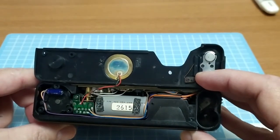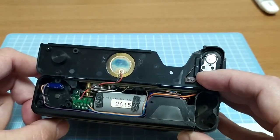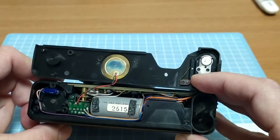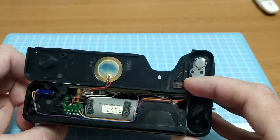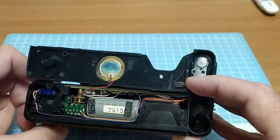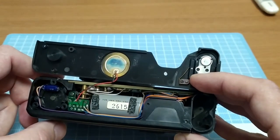It's obviously the very large flash capacitor. These capacitors typically range between 240 to maybe 400 volts and they usually hold a fairly decent sized charge too. For that reason, and because I heard the sound of energisation, we're going to make a discharger and show you how to discharge the capacitor before we carry on with too much work. They do give enough bite that they could actually potentially be lethal - very unpleasant at the least - and if they discharge into a circuit where they're not supposed to, they can do some damage to other circuitry. So it's always wise to discharge these safely and properly.